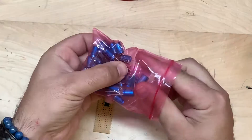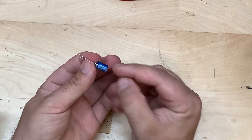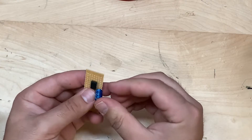The next component that we're going to put on is the 470 microfarad electrolytic capacitor. Make sure the positive lead, which is the longer lead, goes on pin 5 of the integrated circuit, as shown here. And the negative is going to be going to the speaker lead.